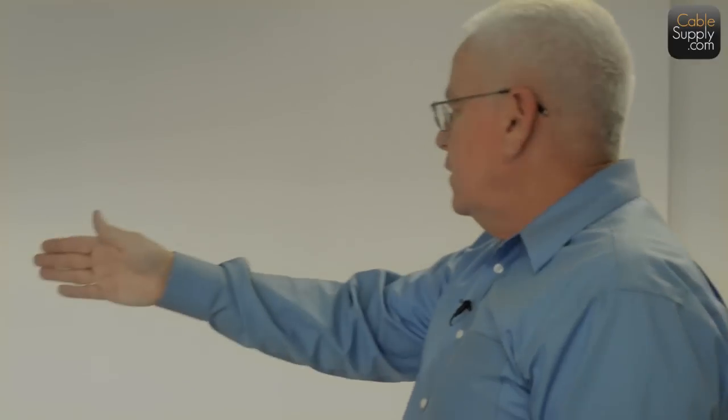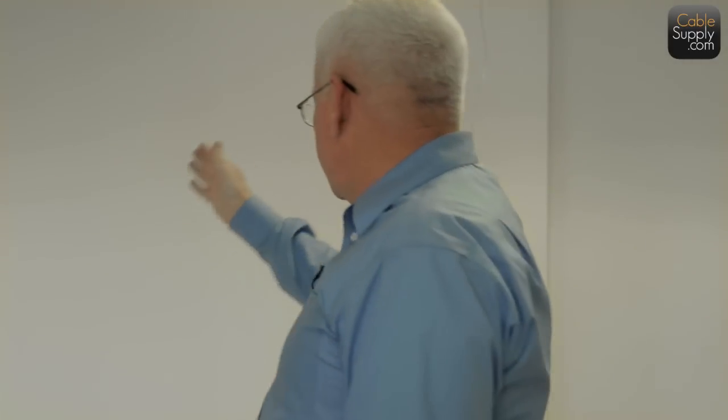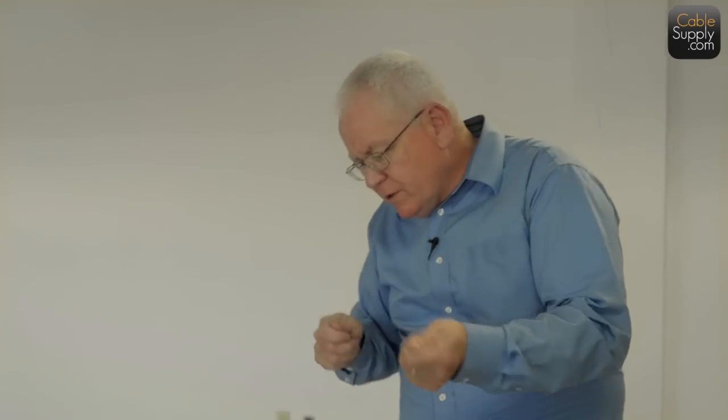And this whole idea that somehow you had to have jack one over there and jack two here and then three and then four and go completely around the room in order is just not professional. And I'll tell you the reason why. It takes twice as long to do that because you've got to figure it out at the other end. Which cable is one? What did I write on the cable? Where did I write? Don't need to do that.